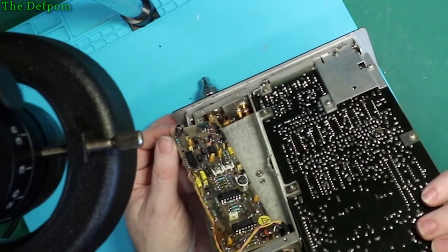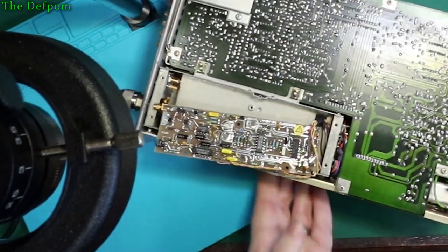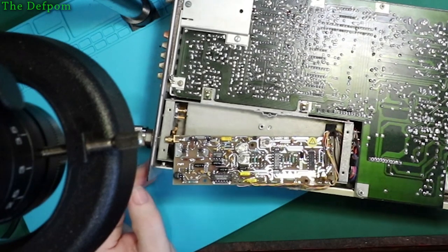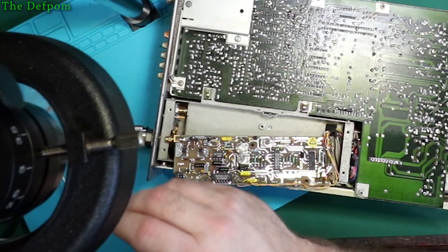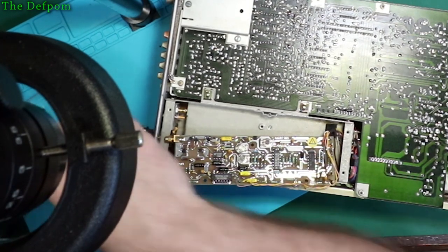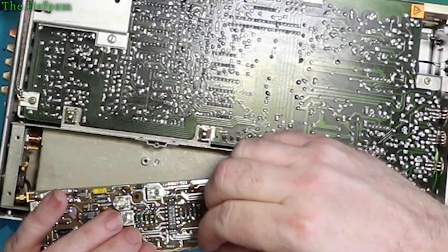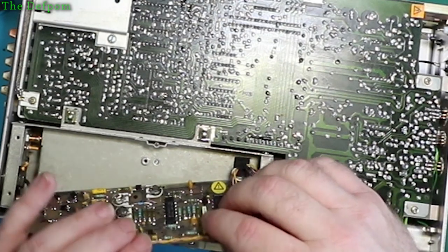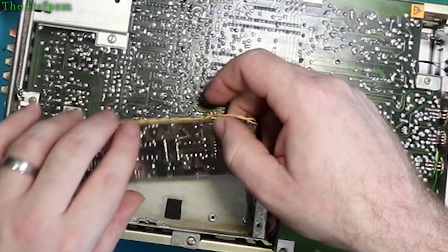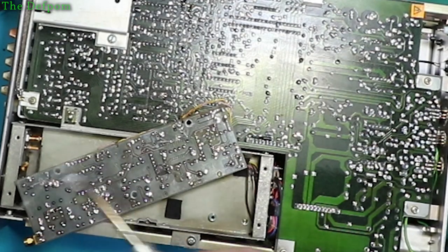Yeah, PN4258 is that transistor. Yeah, I think I'm probably safe to put that 1 uF across all of them. I reckon it's probably okay. So I'll do that. I'd rather replace them than leave them. I don't trust them to be any good. There's 1 uFs as well. Alright. This is only the first bit. We've still got to pull the rest of it apart and check the rest of it out. This is going.